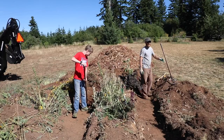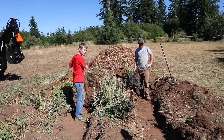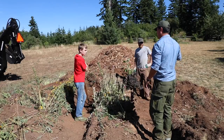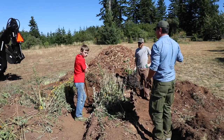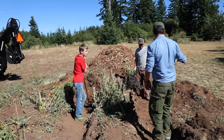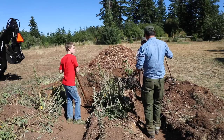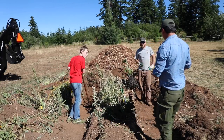Can I make a recommendation to make your life a little easier? I'm going to go get you a scoop of gravel and bring it over here. I'll let you dump it in, Jack — you work with Brian and he'll tell you when to dump. We'll go along and dump about two or three inches, just enough to rake out.